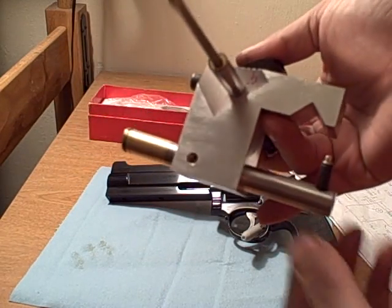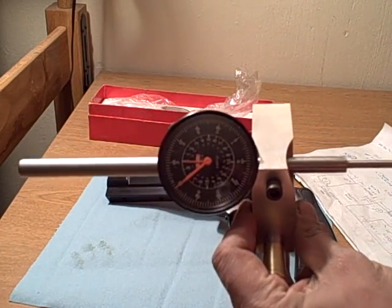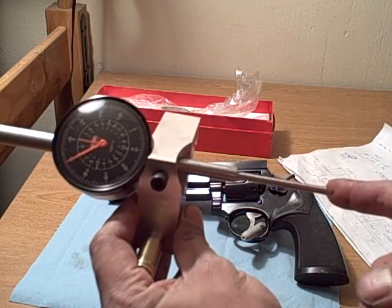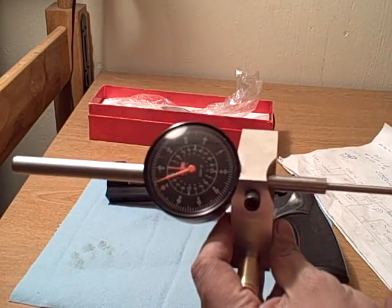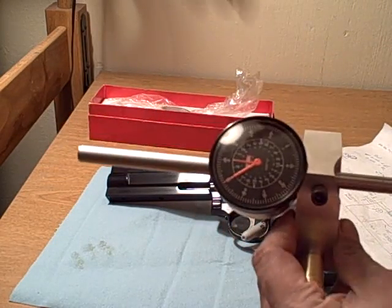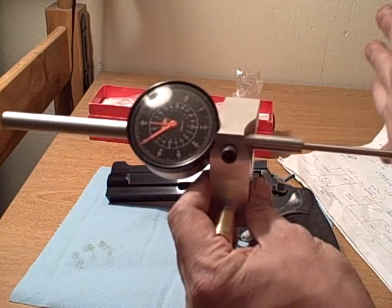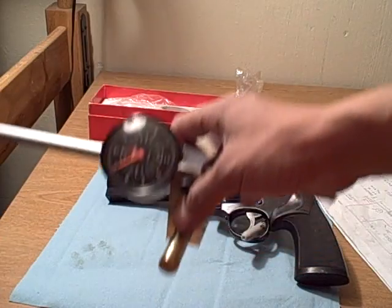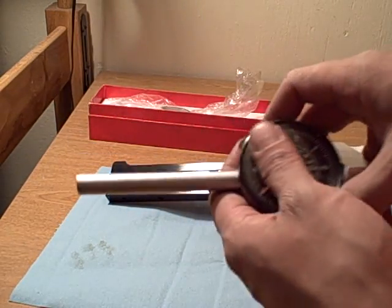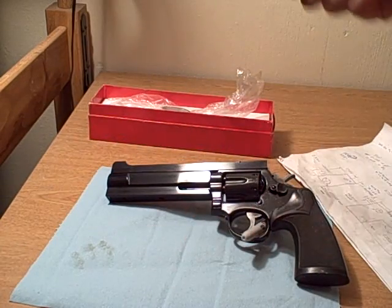When it clips on, it won't damage anything. You just click it on here — I have a set screw here and you just tighten it down in place. The reason you want this is when you're doing precision machine work, you want to measure thousandths of an inch, or even half thousandths of an inch. This clamps onto the track of the lathe, and as it gets closer, it actually starts measuring how much of an inch — say, three thousandths. You see how little that movement is? If you have precision machine work to do and you need the lathe to move in a certain amount, this will ride on the rail and as the lathe comes closer, it will let you measure. Currently we have magnets that do that — a magnetic holder — but this is a better system because it's a mechanical holding system. Sometimes the magnetic stuff tends to slip, especially when you're using cutting oil. When you're dealing with such small amounts — thousandths of an inch — it does matter.